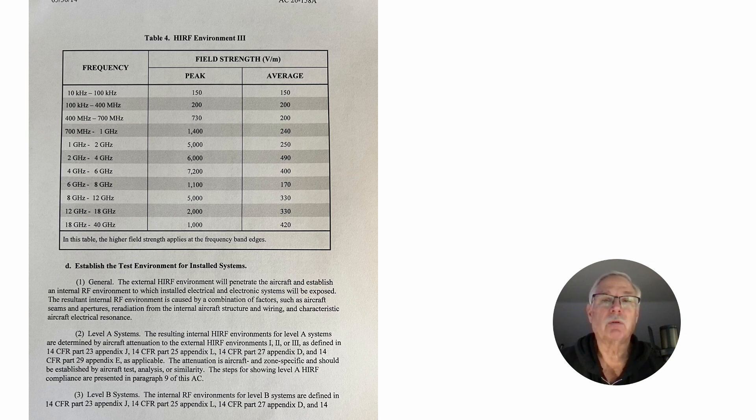This has been over 30 years now and it has proved beneficial. Some of the initial field intensities were a little too intense — we were trying to err on the safe side, but some got so strong that you couldn't have anybody in the aircraft because the field intensities were too strong. They've backed off a bit and made it more reasonable, and things have apparently worked out. We haven't had any events that I've been aware of due to electromagnetic interference. That's a little bit of the history of the AE-4R committee. And if any of my strictly aviation people have stayed this long — God bless you. Thanks for watching.